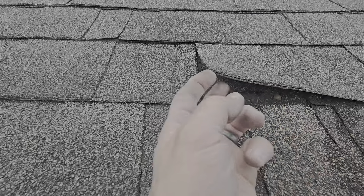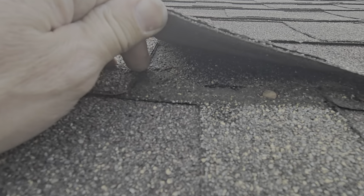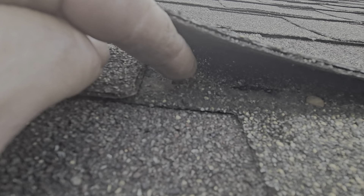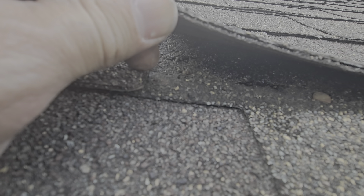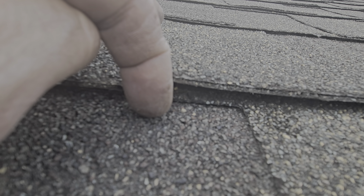You also don't want nails in those areas. That's a common issue — nails in this general area. I didn't find any yet, but you can see where they're raised up and they're rusting. If they're in that area, water's getting to them, they rust out, they cause a hole — you have a penetration right there. Those leaks don't show for about four to seven years, on up to twelve years. That nail is penetrating through that asphalt, making a good seal initially.